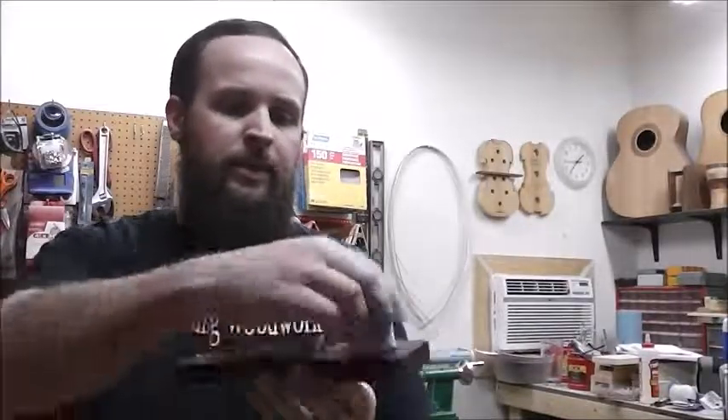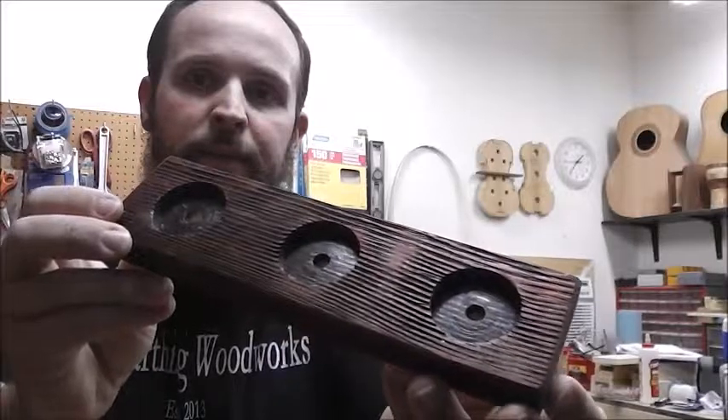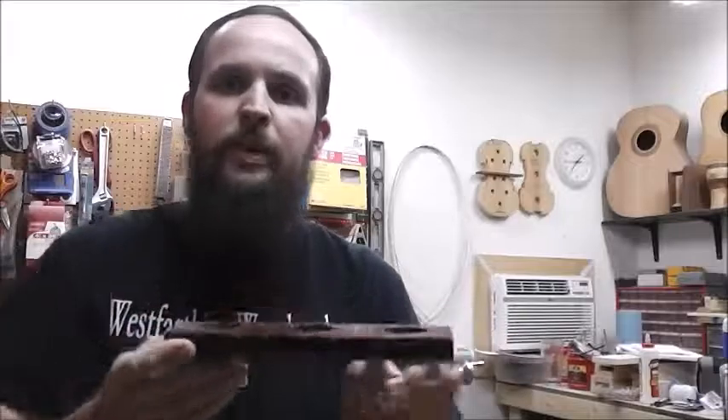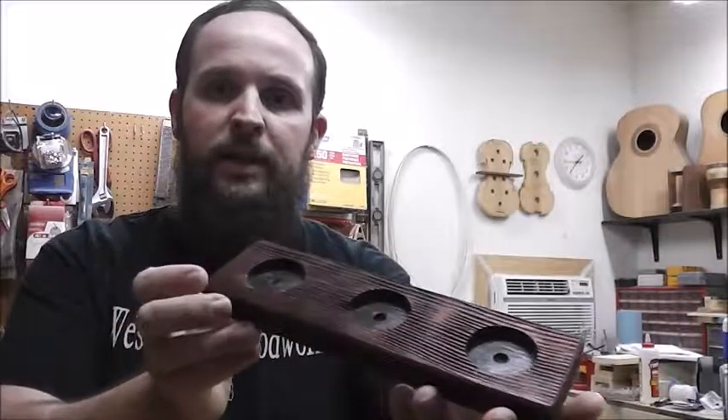What was a lot of fun about this was that I got to use a wire wheel to put this texture on the piece of wood. You can see that texture goes all the way around on the sides and over through the top. I have a wire wheel and I spun it — you can do that on the drill or on the lathe. When you run it along the wood with the grain, it simulates age. It pulls out some of the softer wood and leaves some of the harder areas behind. Depending on how hard you press, you can vary the effect, but this one I did fairly evenly all the way across.